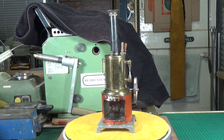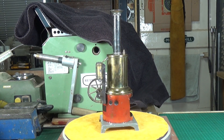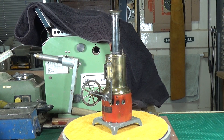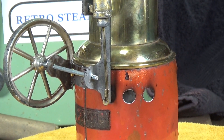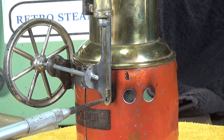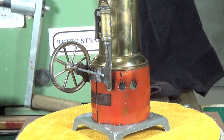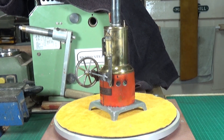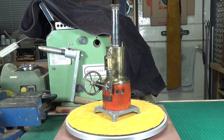As I mentioned, it's missing the crank. There should be a crank on the end of the crankshaft which has a pin that engages with the end of the con-rod. Whedons had various different types of cranks - some used disc cranks with pins, some used a cast soft white metal or lead-type crank. It doesn't really matter; I'm fairly certain I can machine up a little crank for it and get this thing running.